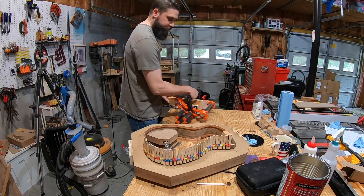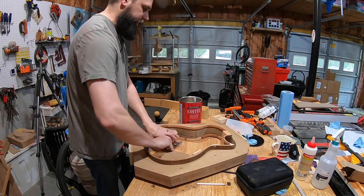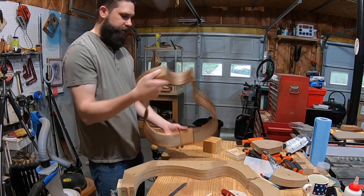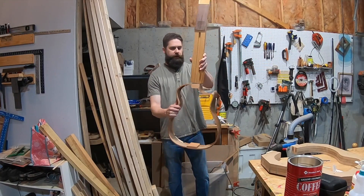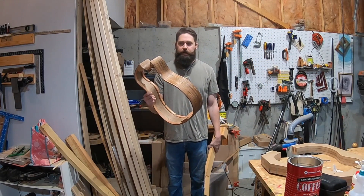While I've got that headplate gluing up, I did start on the top kerfing last night. I'm just glad it looks like it got glued all the way down — I don't see any gaps. This has been drying overnight so I'm ready to remove the clamps. I've got the last of the kerfing glued in and that sat overnight too. Let me get it out of the mold so you can take a look. Oh yeah — it's much more sturdy now. I'll say this is a pretty good stopping point for this video. I wanted to go ahead and get the neck done and have it set aside for whenever I get done with the body. It's looking really cool — I'm excited to move forward. Thanks for your support, thanks for watching, and I'll see you in the next video!